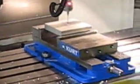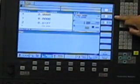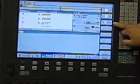If I wanted to edge-find instead, I would come back, select the edge-finding option, and there I could pick one edge point, or two points to adjust for skew, or I could find the center of an object just working on one side.